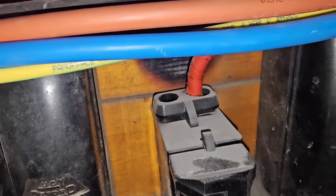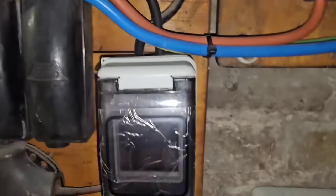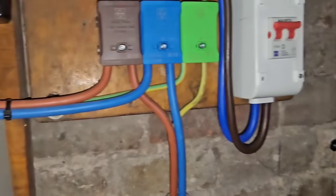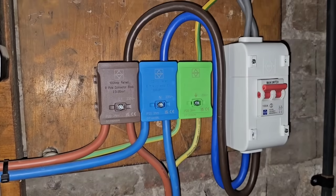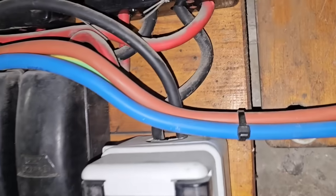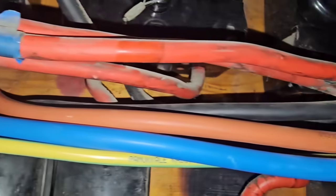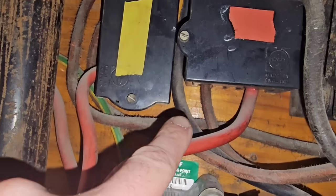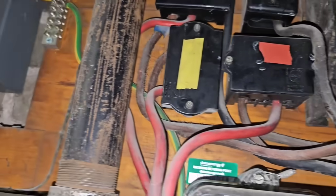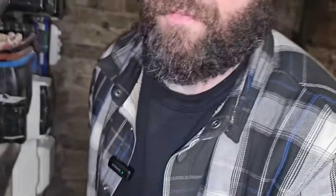The missing meter cover needs reporting; you need to find out who owns this meter. It used to belong to the London Electricity Board, but whoever the landlord is paying their electricity to now owns this meter. We've got this newer one that's been forced on, and they've covered up the neutral block in there — quite clever really, you can no longer see the live parts. The offending fuse still has its original seal in place which is a bit iffy. There are old vulcanised Indian rubber cables still in use here — this is the lift supply, I believe.